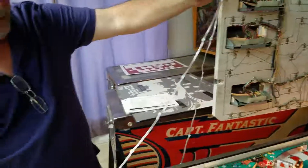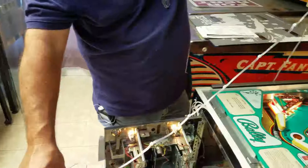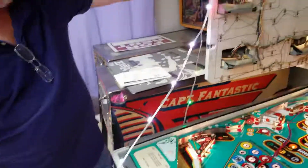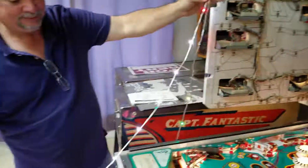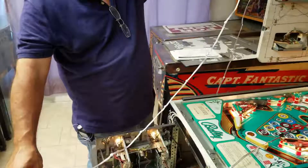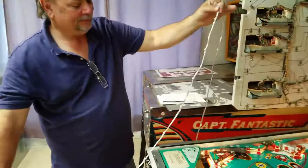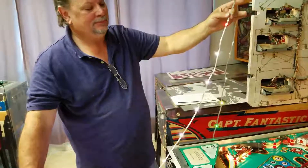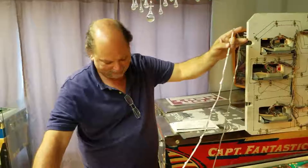We can change the color of these lights if we want the lights under the playfield to be a little richer, depending on the lens they are illuminating. There's a lot of cool stuff you can do to make these lights more effective, more colorful, or whatever you want to do with them. So the next thing we're going to do — probably off camera because it's a tedious and slow operation — is map out and make sure that each of these lights is where we think it is and know what it's doing. Once we've got that all correct, we can go back and lay this under the playfield and then finally program the microprocessor with the order that the LEDs are actually positioned in.